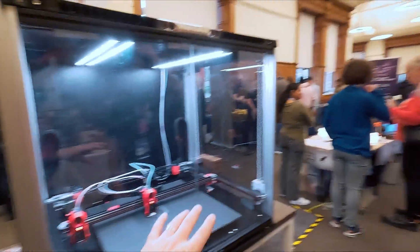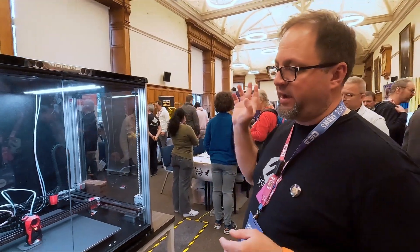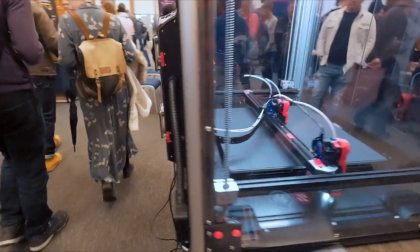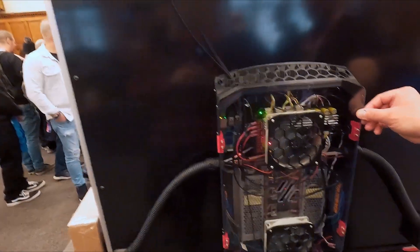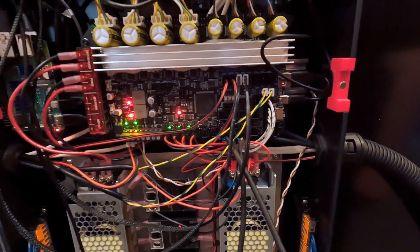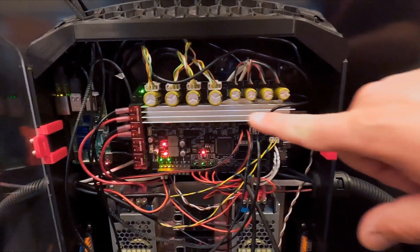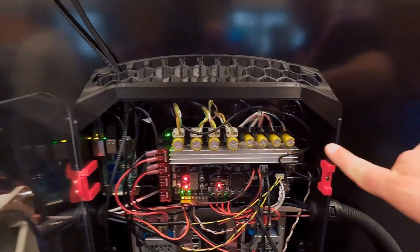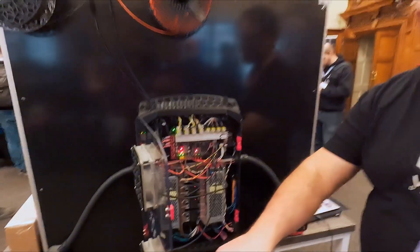It's running both CAN bus boards. It's all BTT hardware in the back. You have a custom board that Big Tree Tech has done for us — a massive, humongous thing called the Kraken. We have four high-amp drivers for X and Y, and then lower-amp drivers for Z because we don't need it. It's ball screws so they gear down.